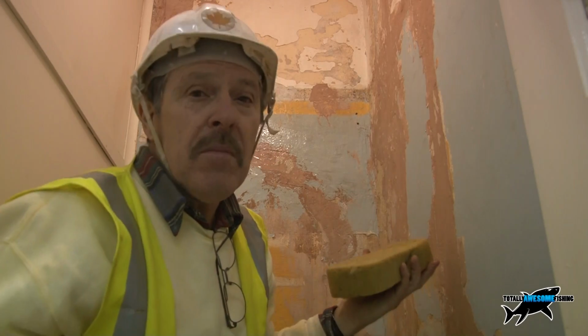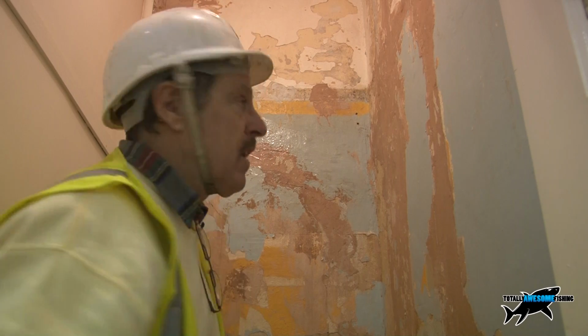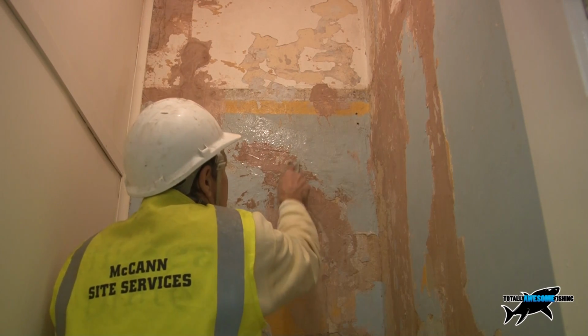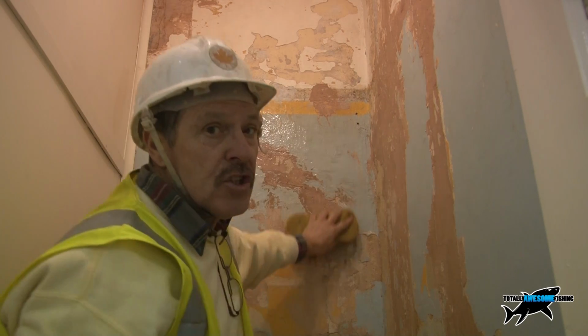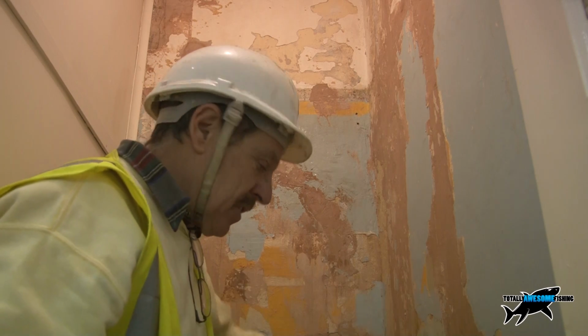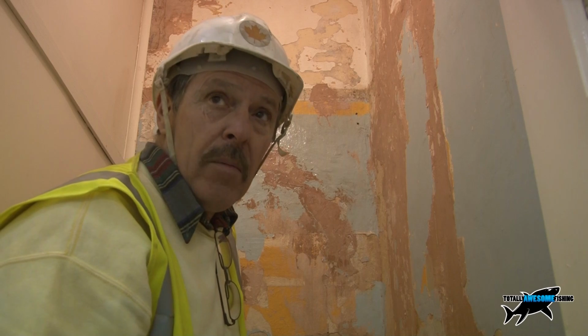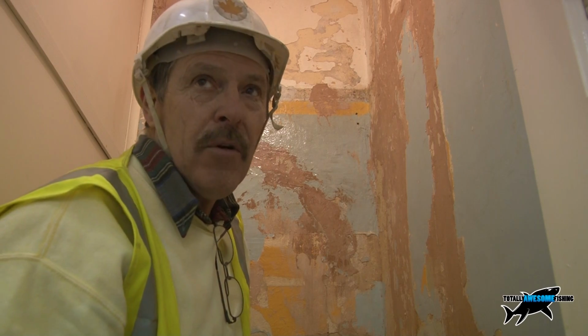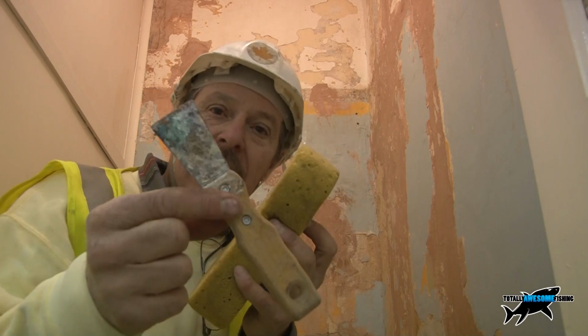So you just soak everything like this, score it backwards and forwards, give it 30 minutes, something like that, go away, have a cup of tea, or work on another section of wall like I do, never stop working. And then when you come back, that will really come off so easy, it'd be unbelievable. You've got to let it soak because it's cold. You can use hot water. I find it's a bit of a waste because it just runs down the bottom and goes all over the floor anyway. Clear up anything on the floor. If you've got carpet, obviously cover your carpet or move it. But that's a cold water soak with a sponge, a bucket of water and a wallpaper stripper.